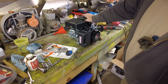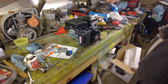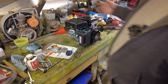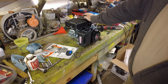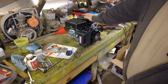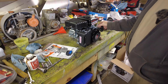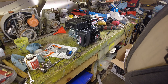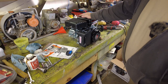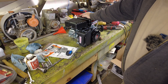That thing runs pretty good. Definitely the governor in it isn't all that good if it's able to rev up to 5,000 RPM, but we don't have any load on this. Once we're actually running the compressor, we'll see what that does. Making 3,000 PSI on a three-stage compressor head is probably going to load this thing down a little bit, and we may have to adjust our stop screw once we've got everything installed.